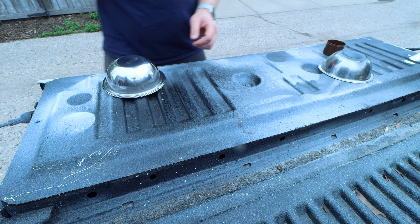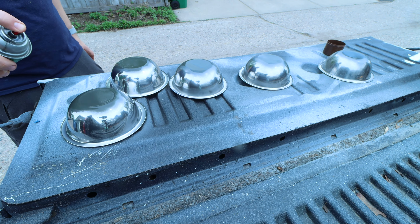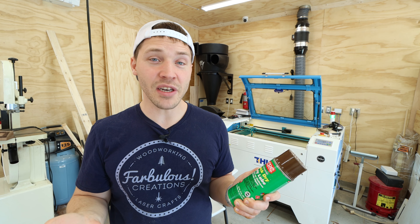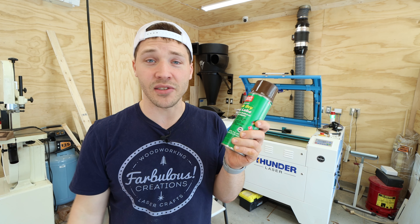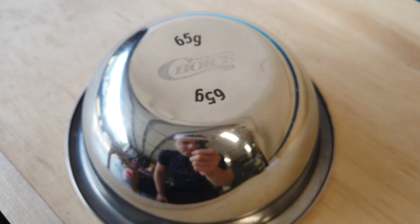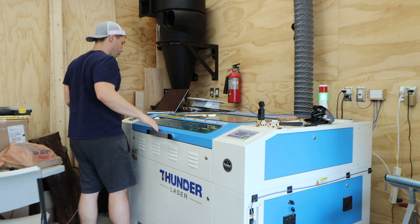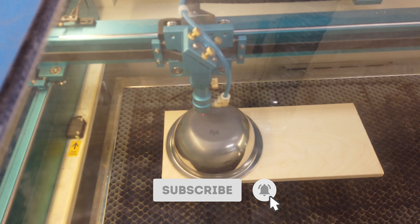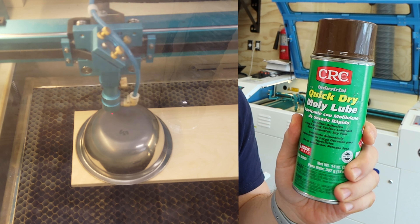Because we have half a dozen of the same style bowl, I had a few more to do and was easily able to batch process them all the same way. So if you're etching on metal with a CO2 laser and you don't need the etching to be super dark, save the Cermark for those important jobs and just use moly lube for everything else. The intent of this video was just to show that you can use moly lube to etch on metal, but in the future I want to do a one-to-one comparison of Cermark versus moly lube on a variety of surfaces, so be sure to subscribe so you don't miss that. In the meantime, grab yourself a can of dry moly lube for low-level or silly jobs like this — I'll have a link in the description.